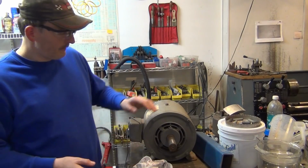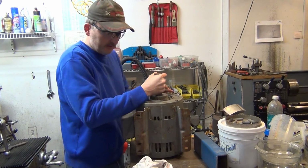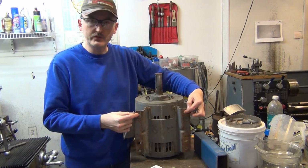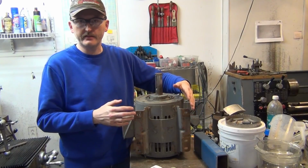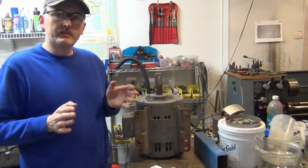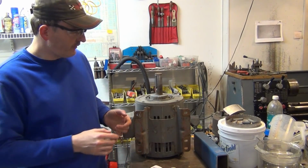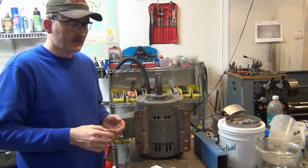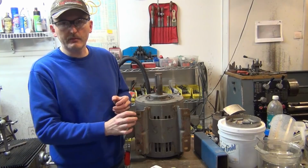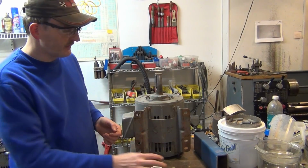In other words, this bolt pattern here is 8.5 inches between these two slots, give or take a little bit, because they allow a little bit of adjustment. The frame rails, if you measure in between them, are also 8.5 inches. So if you made a flat plate and drilled down through to bolt this on, the bottom of the bolts would interfere with the frame rails, and they would go through.